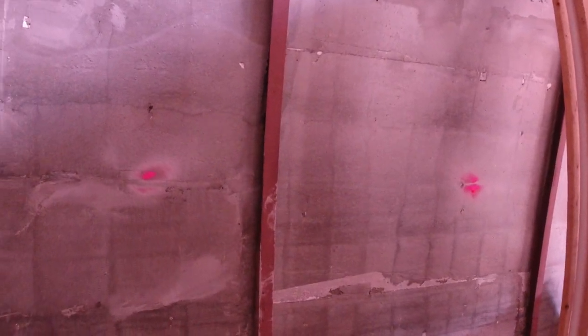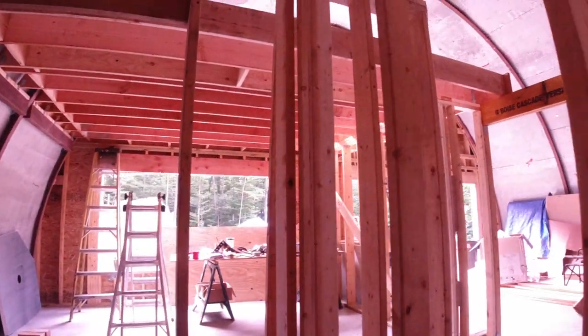Not disappointed from my first try because I think I did okay, especially filling that I-beam. Definitely a learning curve without a doubt. The mortar I used the other day to try to do the walls just wasn't going to work, but it does work to fill the I-beam. So I'm going to fill the I-beam and some deep holes. We did buy something new called Quick Wall, and I'm going to give that a try later on today. We're on a mission to get those walls done.